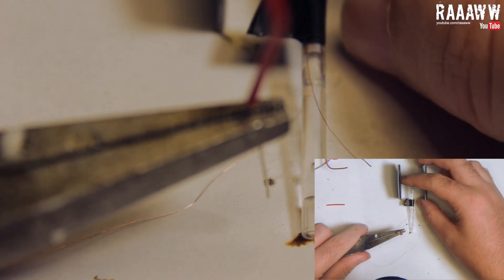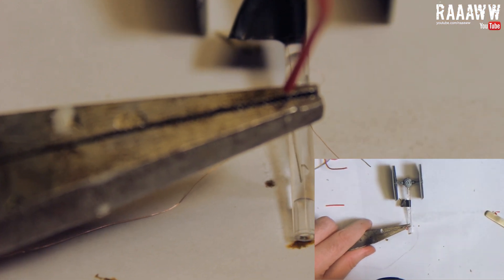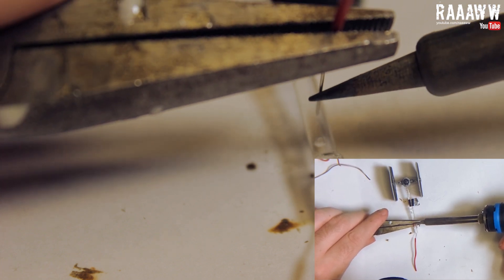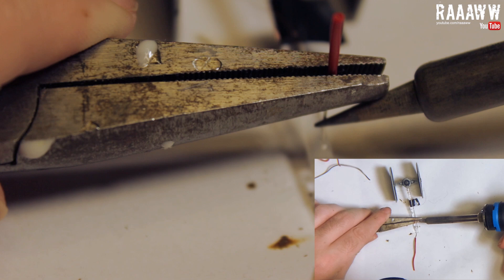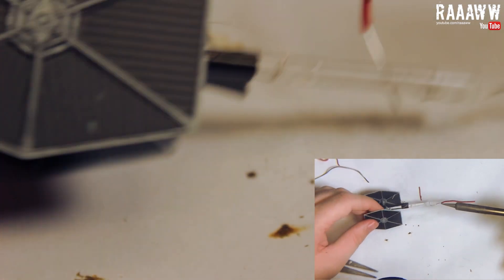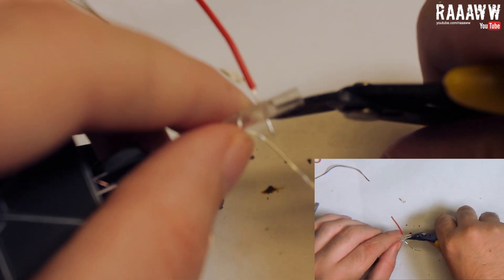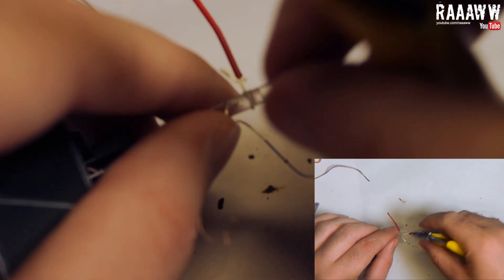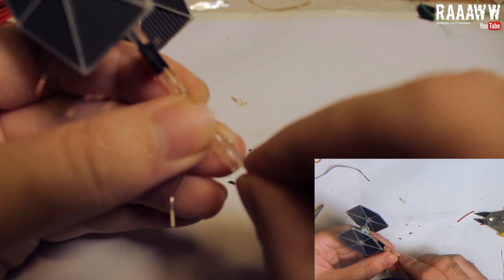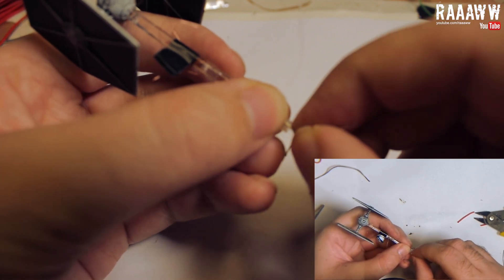It is now time to make the connectors. Take a pretty long piece of full core wire and strip it partially. Take the full core wire that we just stripped and place it so that the tip touches the back of the stand, then heat the metal up with the soldering iron — it should start to melt through the stand. Let it melt until it comes out on the other side, then do the same from the front. Avoid any air bubbles or the space where the rod connects to the base plate. Cut the wires as close as possible to the stand. You can put some super glue where you made the cut so that it doesn't get a shock. If you mess up, you can still remove them by heating them up again. Make a 90-degree bend on the wires downwards, then twist them into a shape like this.